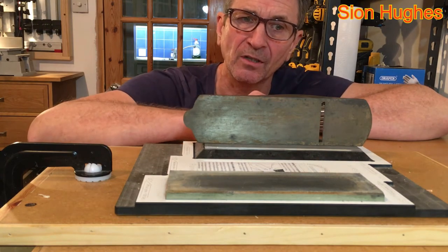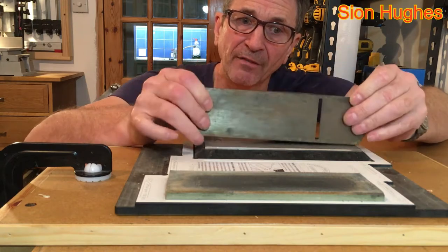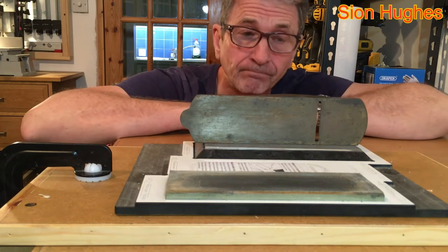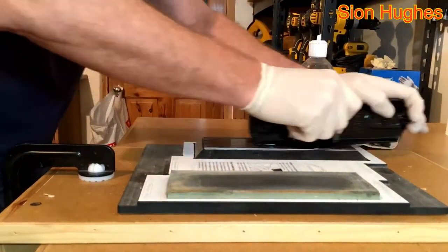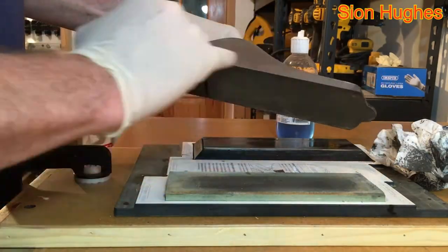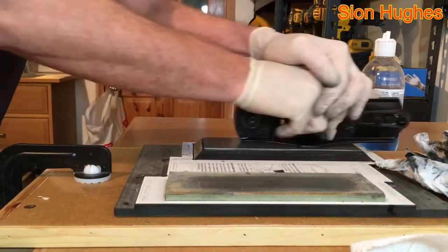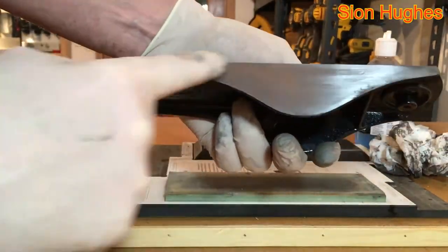I put some lapping paste on it and set it on time-lapse, so you should see a real increase in flatness of the surface and consequently shine. I'm looking to reduce the pitting on the outside and get a nice clean machined look — a flat surface, because it's done on effectively a miniature surface plate with 400 grit diamond on it, it should be absolutely machine flat. The paste I'm using is by Trend — diamond abrasive lapping paste, a very creamy liquid, and it's expensive. Here you can see me pointing out the little low spots that are remaining. Effectively you have to remove all of the shiny material in order to get to the pitted material, so this is an exhausting and laborious process that really relies on continued elbow grease. But it's worth it — it works out in the end.